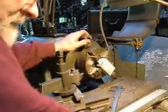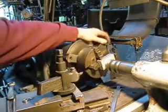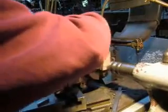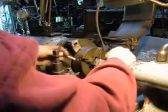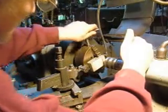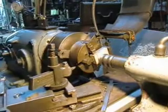Then I bring up my center tool and you can see it's a little bit off. I can get generally centered by using a live center — just flipping it back and forth until we're centered up. That looks pretty good, still a little bit more. Let's see if we can just nudge it in. Yeah, that's pretty good. Back and forth, looks like we've got to go a little bit in this way — and we're pretty close I'd say.